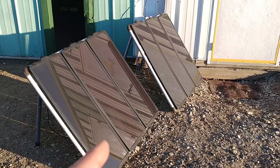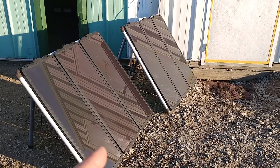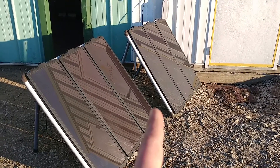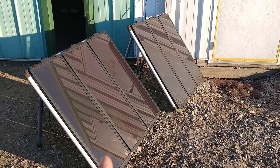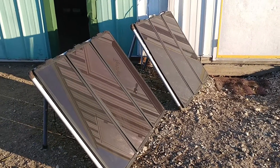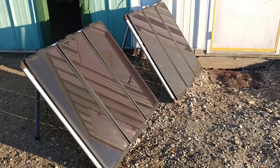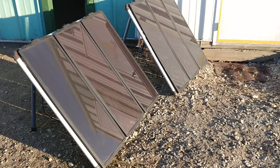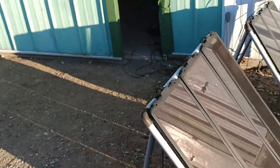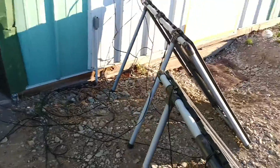What I've done is put these panels in series, so I've got 12 volt plus 12 volt plus 12 volt plus 12 volt for a total of 48 volts of solar panel going in. That increases — that's not the open panel voltage — but you can do some research on that. I've got all four of those in series.